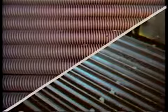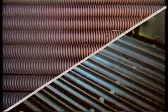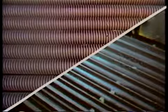Excessive ash accumulation is a particular problem in the economizer. Most economizer tubes have fins or gill rings that can become blocked with ash more easily than bare tubes. There's another problem. Economizers are subject to accumulations of unburned fuel. Now, this is a fire hazard and is potentially explosive. When checking for ash blockage in the economizer, be sure to see if the ash includes unburned fuel.